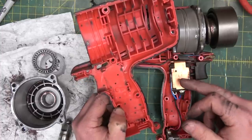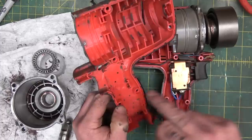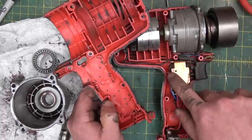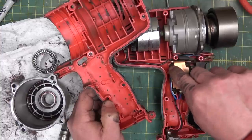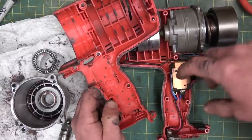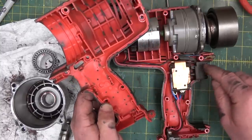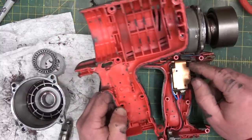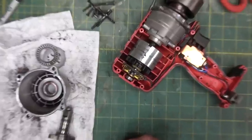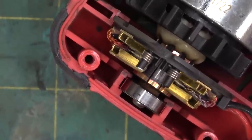On account of this being used, we can see some interesting artifacts of the fitment here — the copper heat sink fretting on the casement, and some hot spots, all nice and shiny on that. That's not a mechanical component, that's an electronic component, and it's probably not designed to be squeezed like that. So it is a little bit of a fitment issue — no big deal, but you see, it is fretting. First rule: troubleshoot and do the easiest thing first — have a look with your eyes.